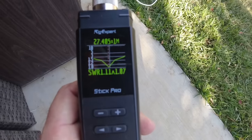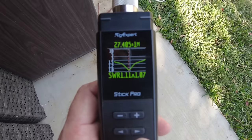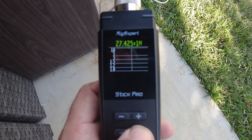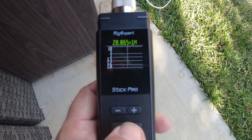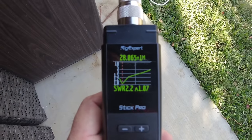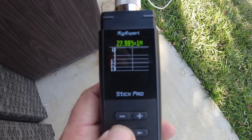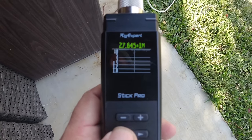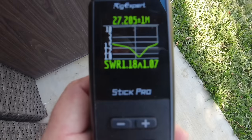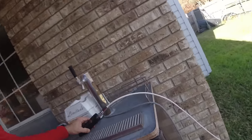So it's actually running a little bit short because SWR is lower at higher frequencies. That begs the question: what does it look like at 10 meters? Unfortunately it's not wide-band enough to get there unaided — at 28.065, close to 28.074, it's about 2.2:1. Most radios, including my IC-7700 and Flex Radio in the ham shack, will handle that fine with the tuner. There are instructions in the manual to tune it down to the 28 to 30 MHz range, and it's rated for commercial, ham, and CB use.